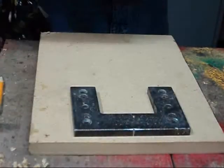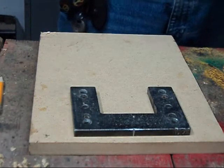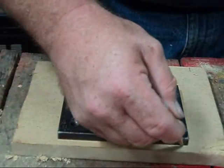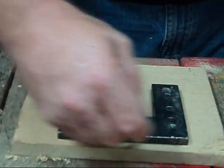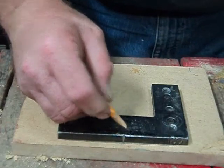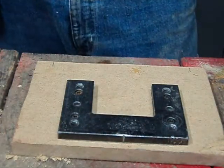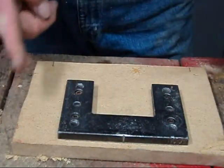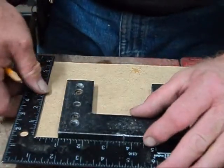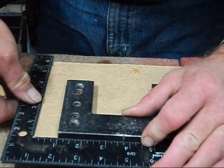Get your plate on and all four screws. If you use the right holes, all four screws line up. It doesn't really matter if it's a little bit off square, because we're going to measure off of the plate. The front knife is going to cut right about here. We have our center marked. Half of 7 and 9 sixteenths, which is our width, will be about 3 and 3 quarters.